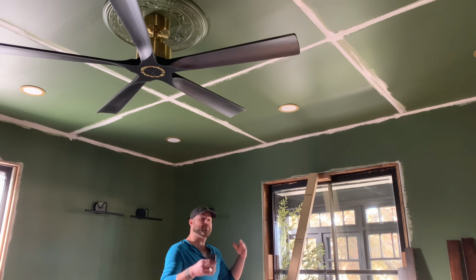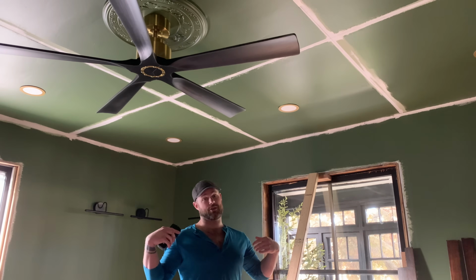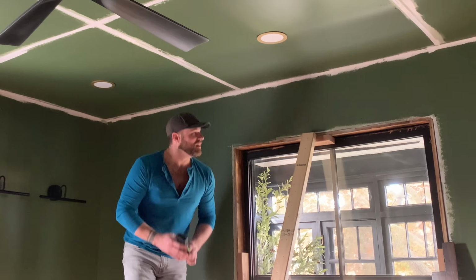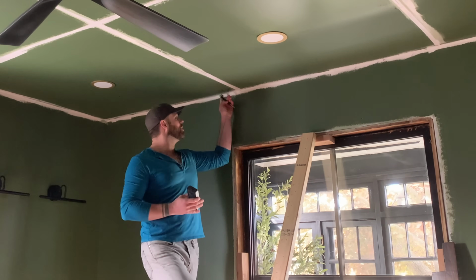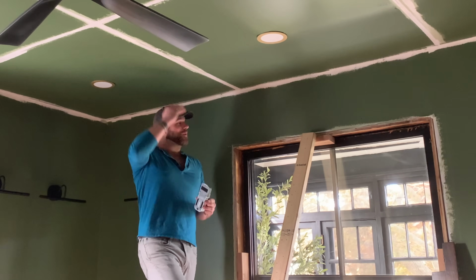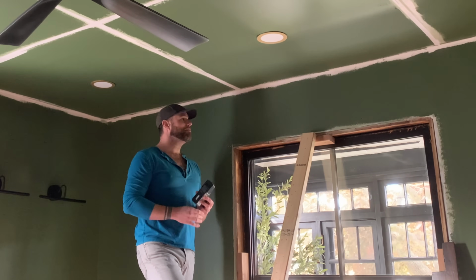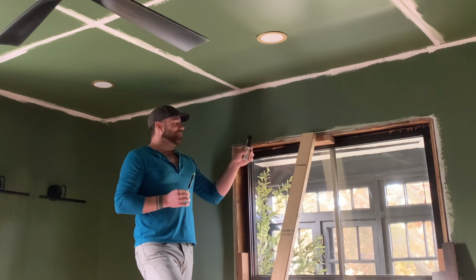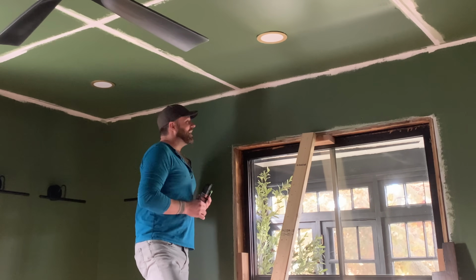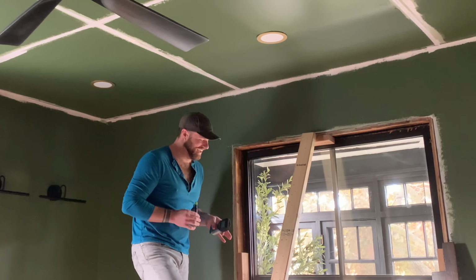Smart Sean, who lives in the past and is often quite separate from me, Sean. I'm Sean, restoring Sean. Smart Sean, who lives in the past, left the plaster off the screw heads going all the way around the perimeter. I did that specifically so that when the time came to put at least the perimeter pieces up, I would know where to drill them without having to resort to this. So that is very exciting because it's less work I have to do right now.